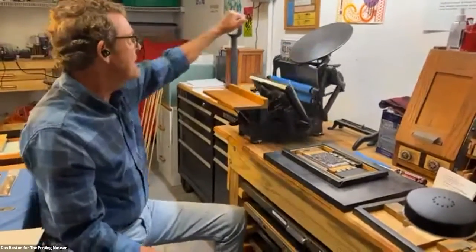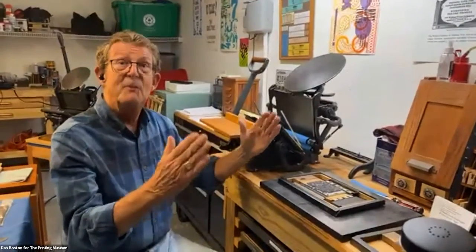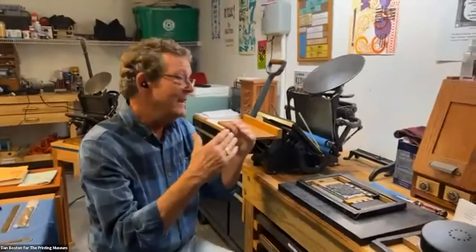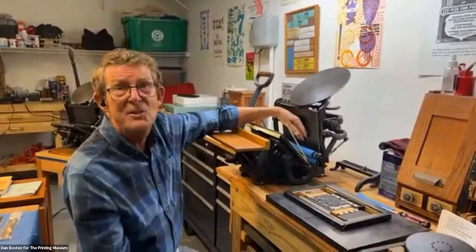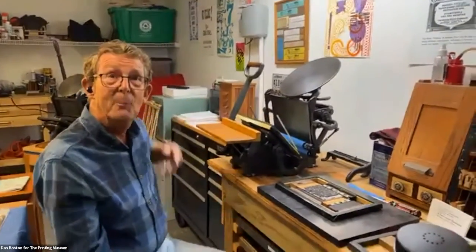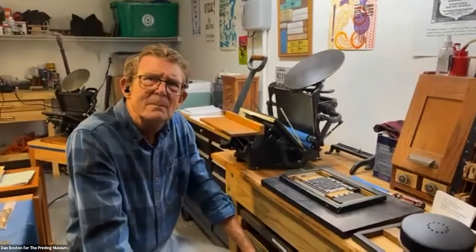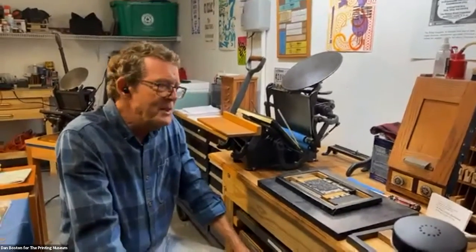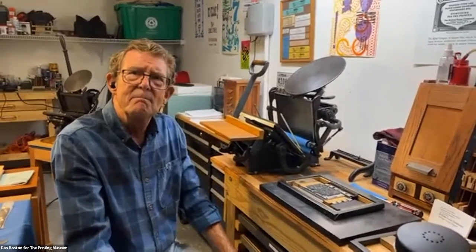And most presses, even floor model presses, have problems if you're trying to use that whole area. It's either the bed that works, you know, 1,000th of an inch, or the platen that'll work a little bit, or a little of both. So it's less about damaging the type and more about you could damage your press, and you just have real trouble getting a good impression.